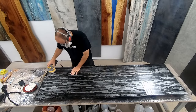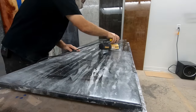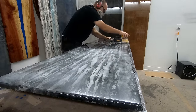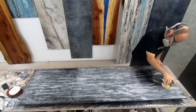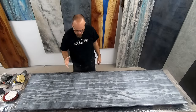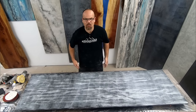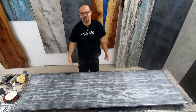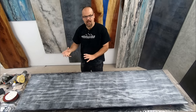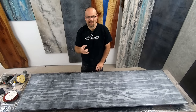On this first disc, all we're doing is taking our 220 grit sandpaper and using that until we get rid of any protrusion — anything that may be sticking up out of the surface. We're feeling with our hand as well as sanding, just to make sure it's nice and smooth. Whenever you're sanding and polishing, you want to go both directions — we went lengthwise and then perpendicular. Just a couple of passes with each grit is all you need. Now I'm going to address the edges: I'm going to turn the speed on my sander down, get rid of any bumps on those edges, and then do the cove by hand.